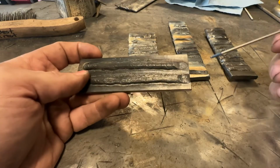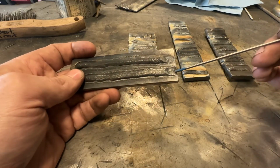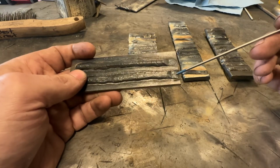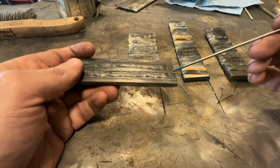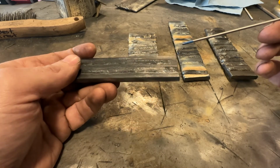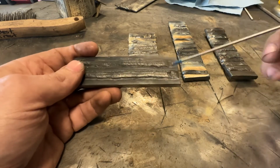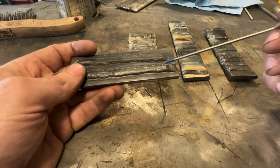And what I adjusted, and maybe your welder for wire welding has this, maybe not, but by changing my burn back setting, I was able to eliminate the ending porosity. The burn back was factory defaulted at, I think it was 0 or something. I changed it to a 5 out of 10. And look at that, there's no more ending porosity and it no longer blows out the end of the plate. So I think it was just set far too high or whatever. Not really sure, but little simple tweaks can make all the difference in the world.